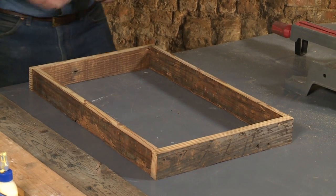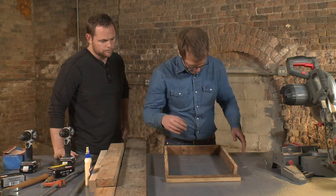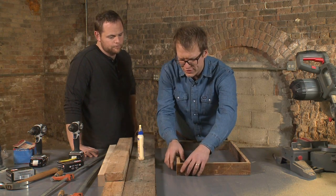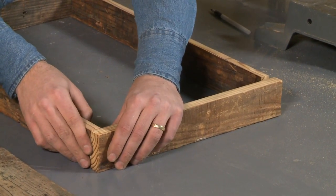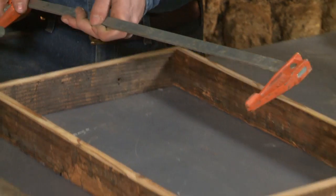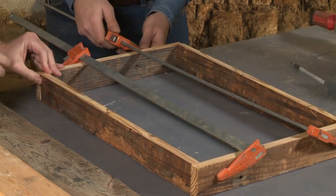There's our simple box. I'm going to put a little bit of wood glue on here — think about what side you like better and face that out. This is a very basic woodworking joint; we just call this the butt joint. It's not the finest joint around, but a little glue will strengthen it up. Then we take these clamps to hold the box together nice and tight. Now that we're clamped, it's time for some finishing nails.